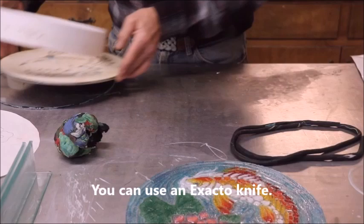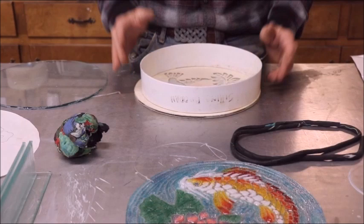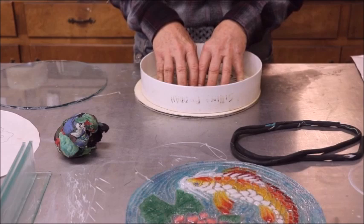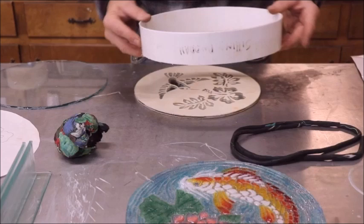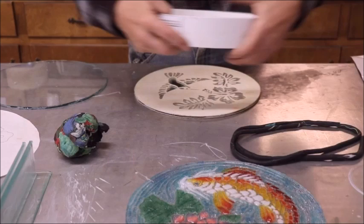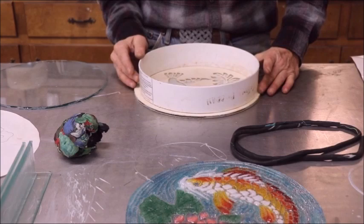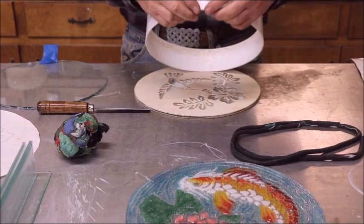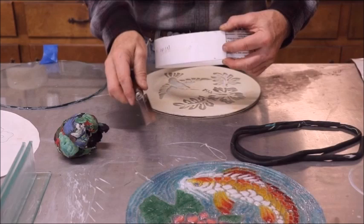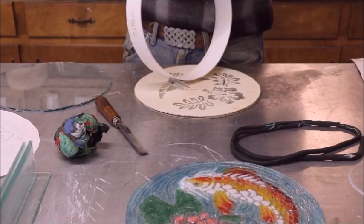When you get all that done, we need to cast a plaster mold first - that's what we're going to do. After the plaster mold is dry, we're going to cast a ceramic mold and fire it. I'll cut this off screen in just a second, but you're going to use about two inches of the drum ring - whatever you're going to use to hold your plaster. If you cut it this way with a knife so you can open it up, it will release from the plaster a lot better. I use a razor knife; they come in different sizes and cut plastic and metal well.